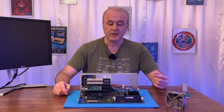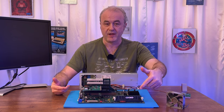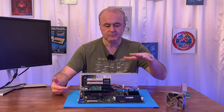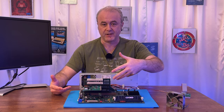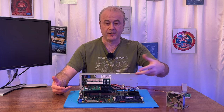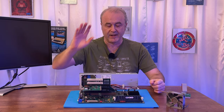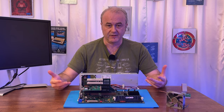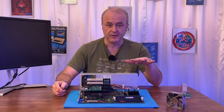The reason this machine needs a test for the floppy drives at such an early stage in the boot process is because it has a very low-level flash utility, which allows you to flash the BIOS on this machine without anything else working. That's really cool. Imagine the BIOS was corrupted and you had to flash it, but you couldn't because the machine wasn't working. Normally, with a BIOS, you put a floppy disk in when it's already running DOS, run some kind of command, which runs a piece of software, and then you choose a file and it flashes the BIOS. In this case, this machine wasn't running. If I had to get into DOS and then flash the BIOS, I would basically be dead in the water. But this machine has a way of doing it without even that running. So that was really cool.